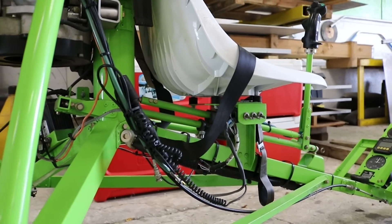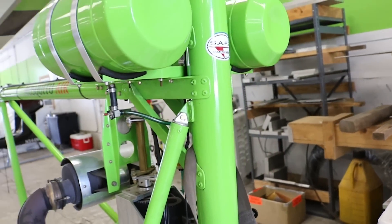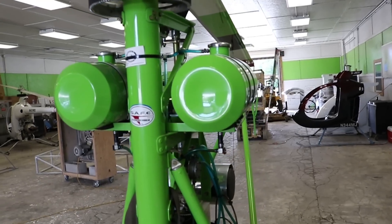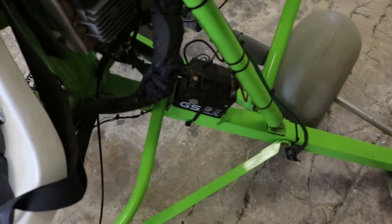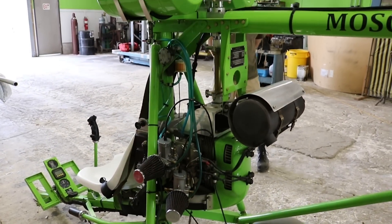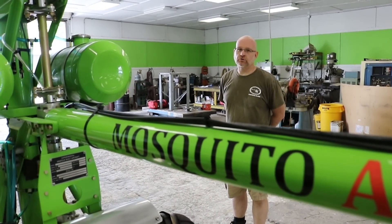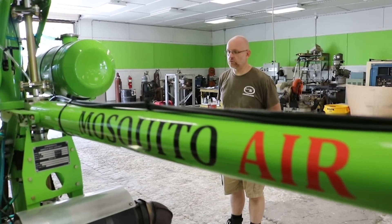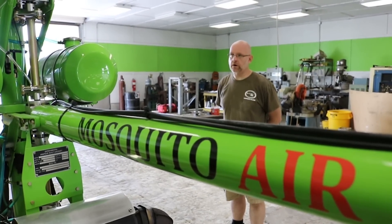This is a remarkable open-air version of what you can have of a flying helicopter. When you're flying, you see almost none of the machine, so it's quite an experience. However, it's not necessarily the best beginner machine. Since it's on a tripod, in order to stay light, beginner hovering and landing skills can be challenged by a tripod design, because it can be prone to tipping or catching. As you lift the machine off the ground, you can catch on a feature on the ground a little more easily with this tripod configuration.